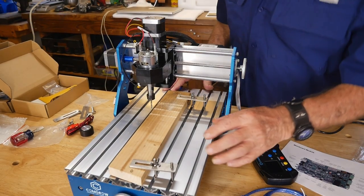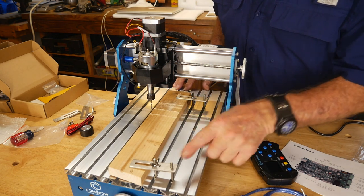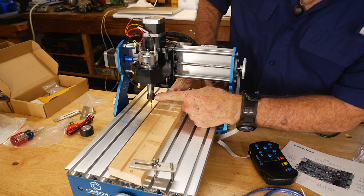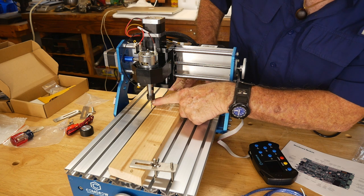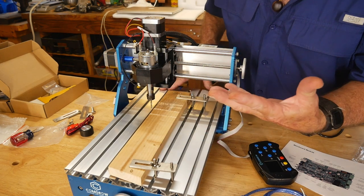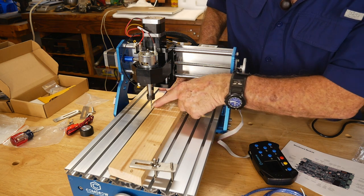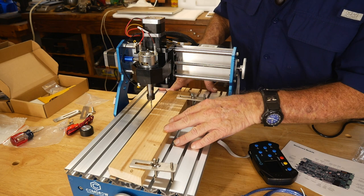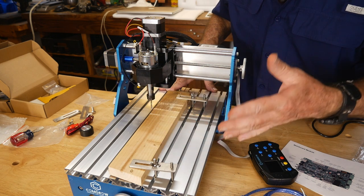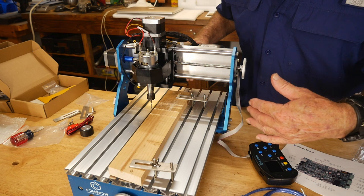Other features include four hold-down clamps with nuts and bolts hardware to secure your workpiece before routing. The spindle has a five millimeter shaft, so you'll need a metric set of bits. It comes with five of each type — flat and pointed milling bits — which should give you plenty to start. You can also vary the spindle speed, which is another great feature. It's a small machine at a small price, but it has a lot of the basics to get your feet wet in the CNC world.